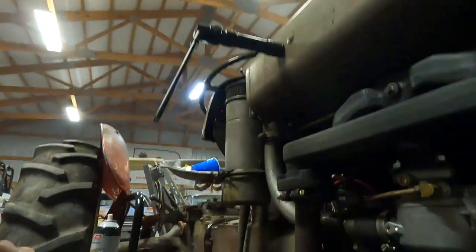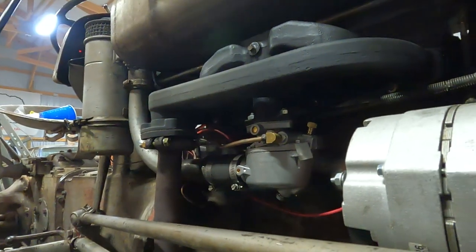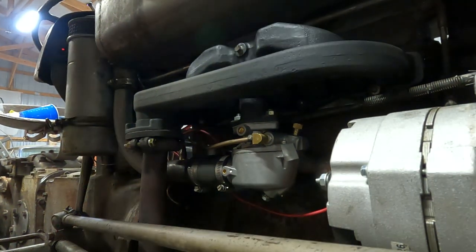So what we ended up doing, I still got to use the old throttle shaft, and believe it or not, the butterfly, or the throttle plate, then screwed into the old shaft. It closed and opened, and the gaps were appropriate. It would come down and cover those idle circuits, and life was pretty good. So we're on. Lights burned out of course, but this is where we're at.